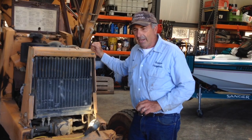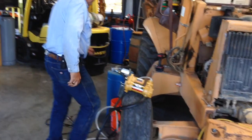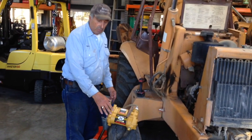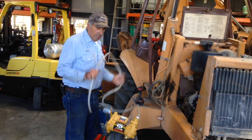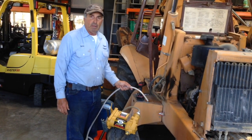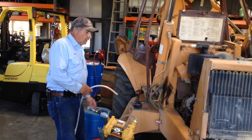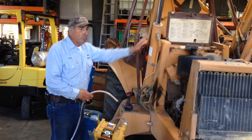I'm a little bit lazy and I also don't like to get dirty. So what I'm going to do is open up the fill line and I have a pump normally used for things like diesel fuel — which it's not being used for now — and I've modified it with a hose that will fit down inside, and I'm going to pump this reservoir dry. The reservoir by itself takes about 15 gallons, and I'm going to put it in this 15-gallon tote. If we drained all the hydraulic lines and the hydraulic rams, you'd use about 25 gallons.